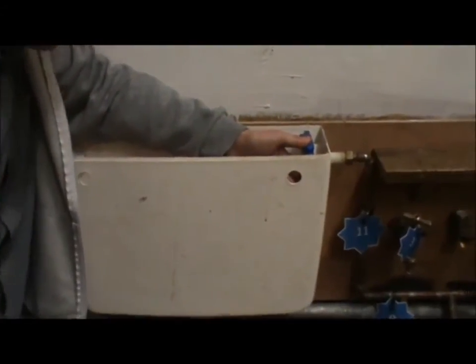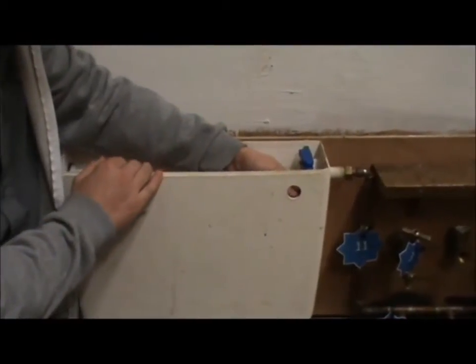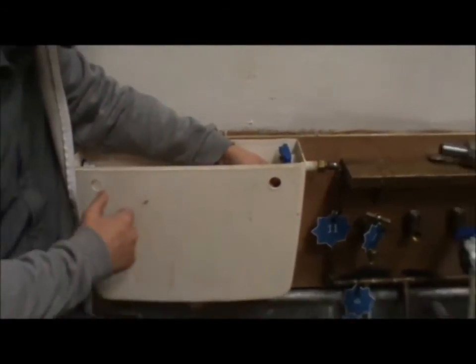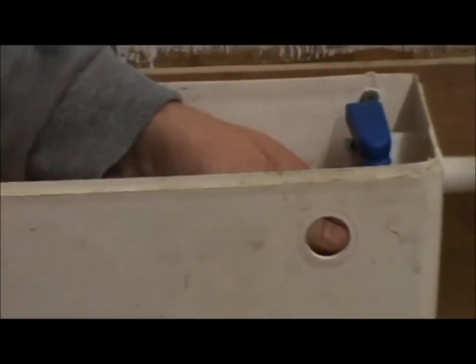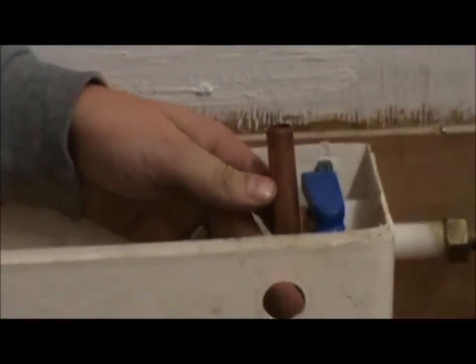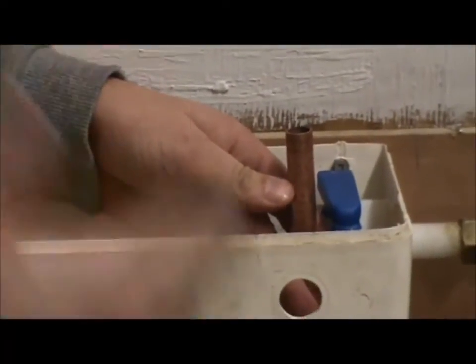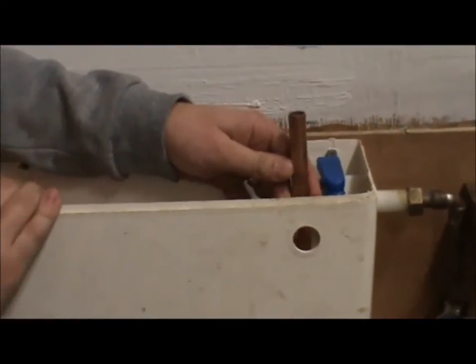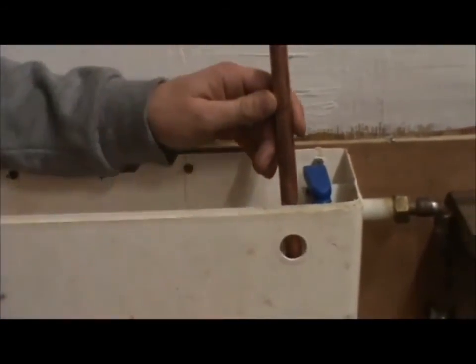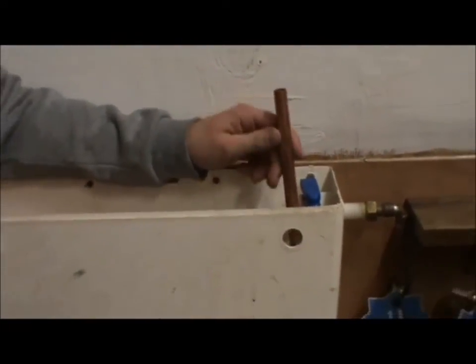This is a plastic WC system and it's got a Part 3 diaphragm plastic ball valve in it, which is correct. But what is illegal is that someone's put a piece of copper tube on the nozzle to act as a silencer. This is illegal because it's a rigid tube silencer, which is a massive backflow problem — that is actually an illegal installation.